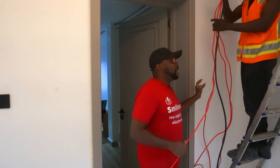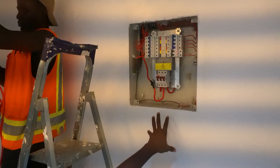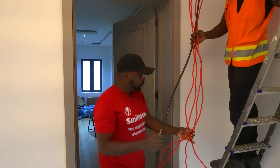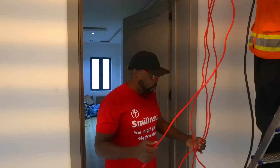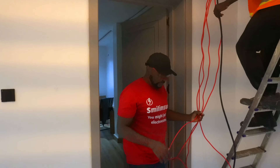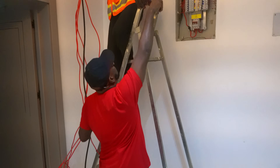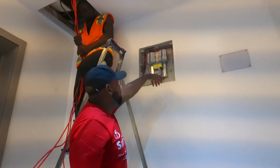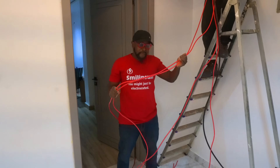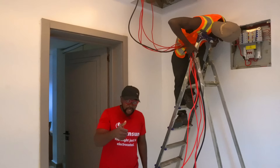Set the Bluetooth app, customize the cables, and you're good to go. We're about to put in the output from the inverter to the DB. This is the nearest distribution point for this house, so the power is going to have to flow in here from this point. We have four cables in here, each representing the lines — the blue phase, the red phase, the yellow phase, and then the neutral that works with every one of them. Then you have the earth cable. These cables are 16mm diameter cables and this is more than sufficient for the load subjection that is going to happen right on the inverter.